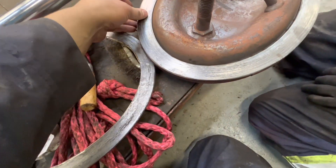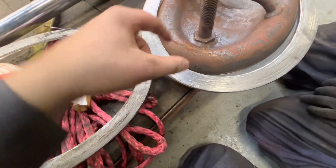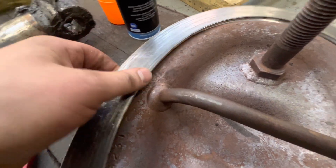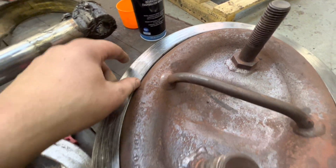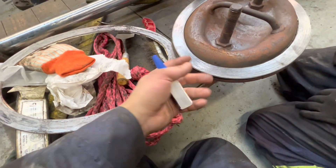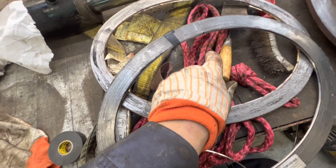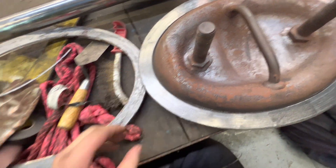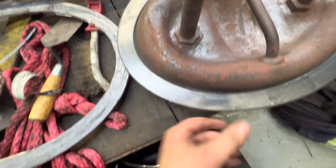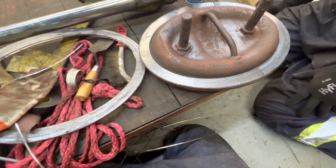You can see it's rocking a bit. After cleaning it up with a wire wheel, we're going to have to zip cut a couple coils and take them out. You can see it's all spot welded inside there, so be careful it doesn't unspool on you. We've got super glue here to glue it in place. We went in about that far and it pretty much fell apart — that's why we tape it up. We took probably three or four links out and it's sitting flat.